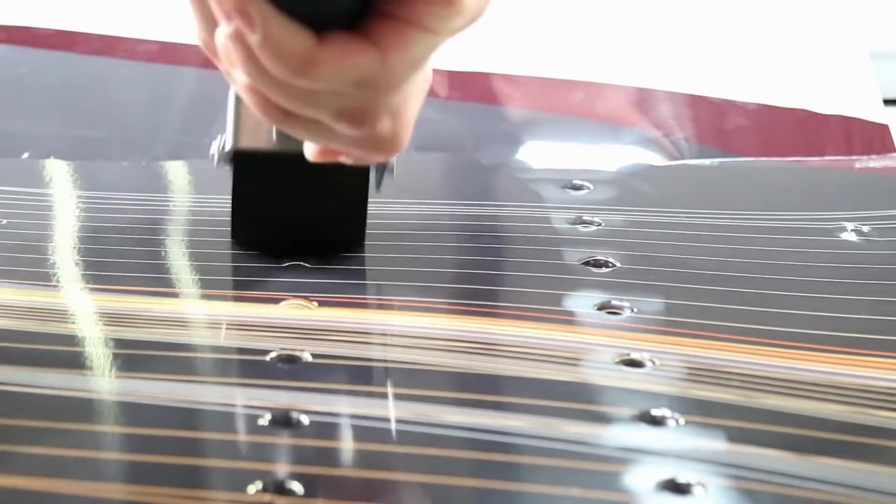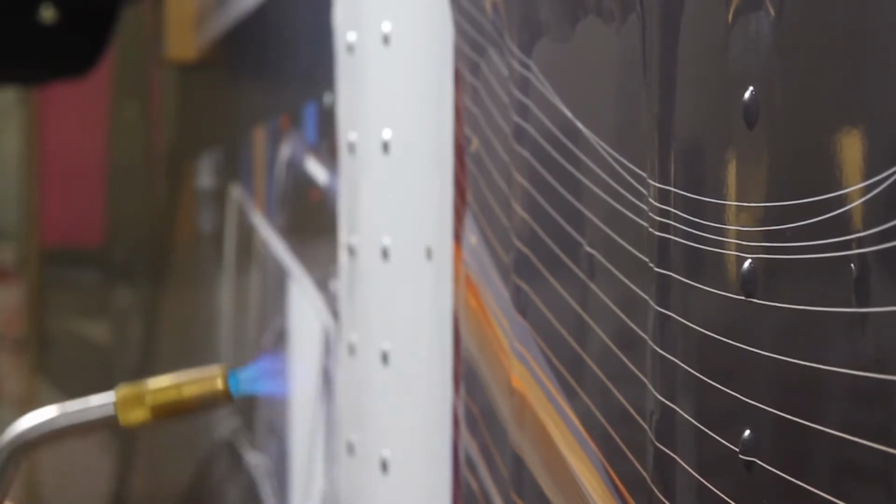Whether you purchase a proper application wheel or just use foam paint rollers bought at a hardware store, be sure the roller is firm and undamaged throughout the entire application. For some rollers, this may mean that you need to change it out several times during the application. Both methods of rivet application are acceptable. So the decision is yours, but if you become comfortable using a roller, eventually you'll be able to install rivets 3 or 4 times faster than the old poke and brush method with a much better result.